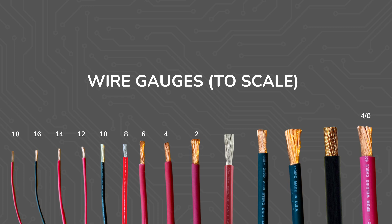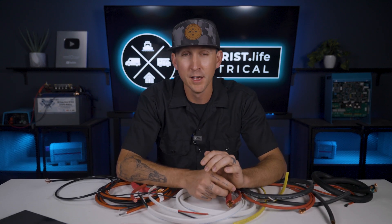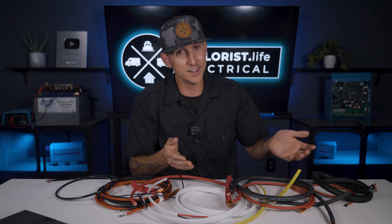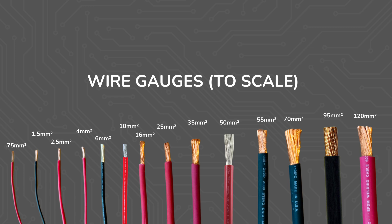But after two, they decided to add a one gauge. And I don't know why, but odd-numbered gauges above one aren't really a thing — a five-gauge wire doesn't really exist as a common size, but I digress. Wires larger than one gauge are zero gauge, which makes perfect sense. But then whoever came up with this mess needed bigger wires but ran out of numbers smaller than zero without going into the negative. Instead of switching to, say, metric — where they would list the wire sizes as their actual dimensions in millimeters squared — we just decided to start adding zeros.